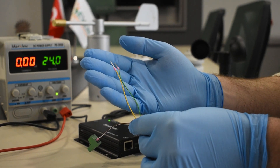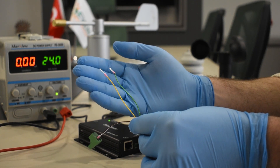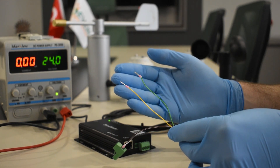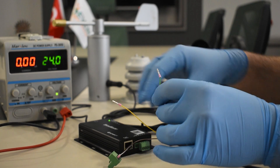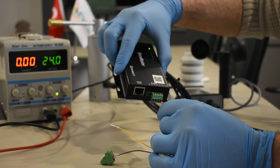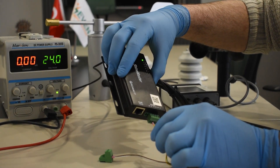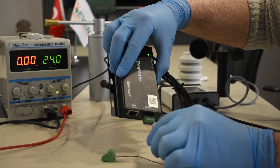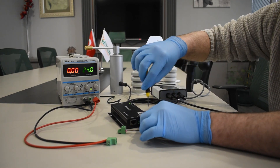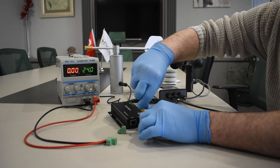The green and yellow wires are connected to the Modbus port on the ShineMaster data logger. The ShineMaster data logger has two Modbus communication ports. After choosing which port you are going to connect to, connect the green wire to the input specified as port A or data plus, and the yellow wire to the input specified as port B or data minus. If more than one device is connected to the port you have selected, the device IDs must be different.